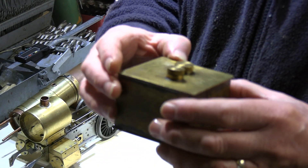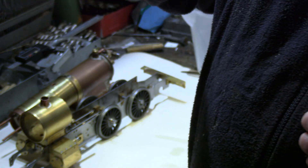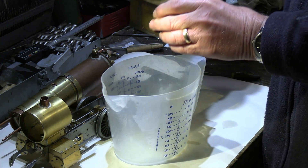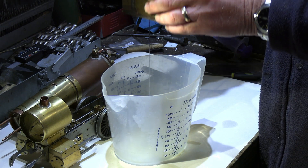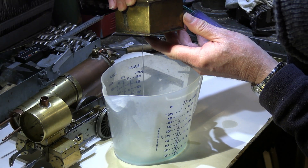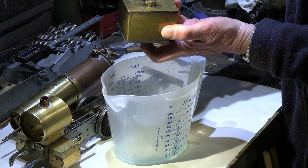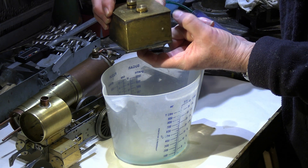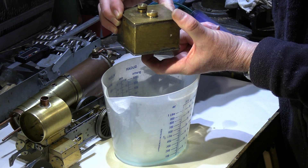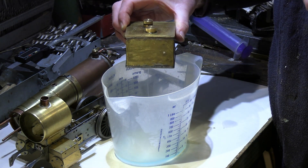Here's the tank, similar to what we saw in the diagram. We've got a filler and this goes down to a needle valve underneath. The reason no fuel is flowing at the moment is because the needle valve is closed. If I open the needle valve you should see the fuel flowing — and you can see the fuel is flowing. Now if I put my finger under the breather pipe, the air pressure is slightly less there and the fuel stops flowing. That simulates the same thing as the breather pipe being submerged in fuel in the sump. As soon as the fuel burns low and exposes the breather pipe again, the fuel will start to flow through the needle valve. That's the simple idea of how this works.